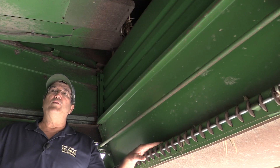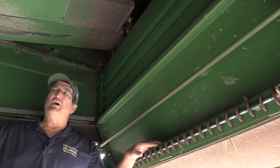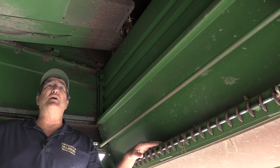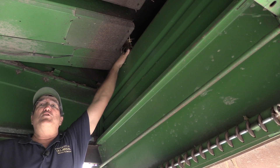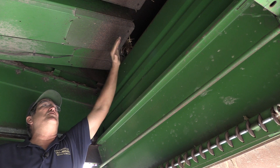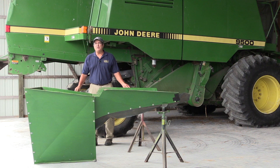Another approach when designing this is from the back end of the combine — once the chute is installed, you've basically blocked the sunlight and can't see through. There's also a piece of metal on this combine that goes up and over into where the straw gets distributed, and we were losing weed seeds up there. So we had to fashion something to prevent the flow of air up over that piece and into the straw. We'll show that piece in a minute.